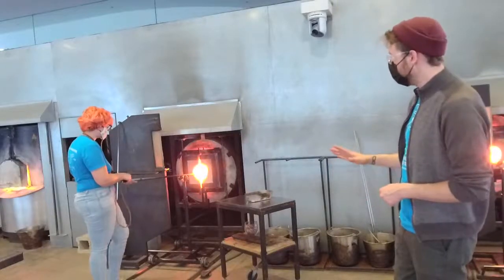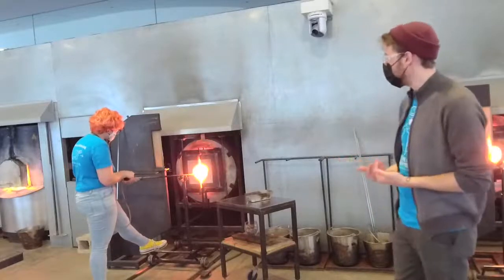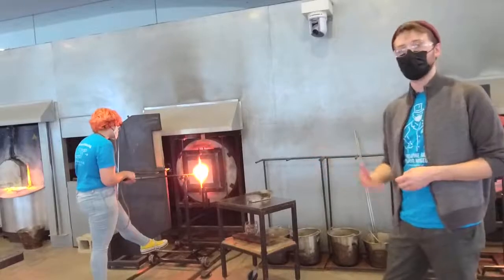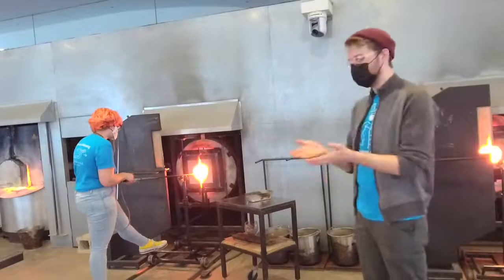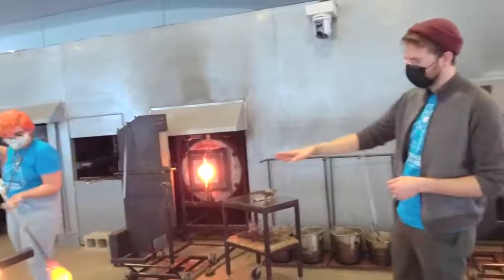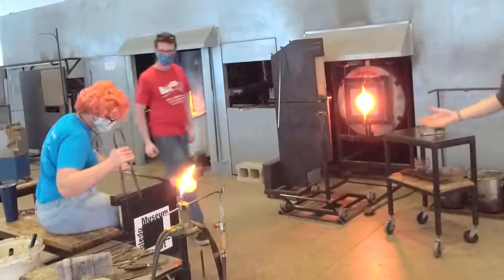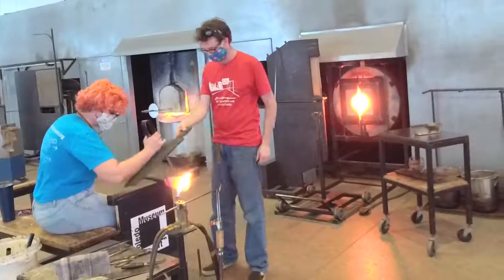Though the cone is simple in terms of geometry, it's difficult to achieve on the blow pipe cleanly. We're gently blowing everything out, making sure the area of the bubble closest to the pipe — what we call the shoulder — is nice and thin. We want to retain the majority of the thickness toward the tip of the bubble, because the tip is going to be the bottom of the wizard cap, so we want it bottom heavy. Kelly swings downward, allowing gravity to do the stretching.